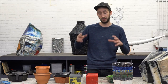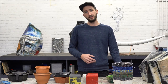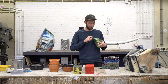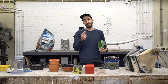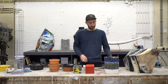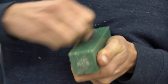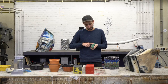If you make plastic products from the soft category, it really pays off to make a proper mold and finish as little as possible on it. But if you do need to make some edits, I would highly recommend getting a super basic knife. Say you have a bowl with a little rough edge — if you sand it, it doesn't really work because it's too soft. But with a little knife you can really scrape the edges super clean and smooth again, because the knife creates friction which heats it up a little bit and makes it super smooth. It's a super basic technique but very effective to get rid of rough edges.